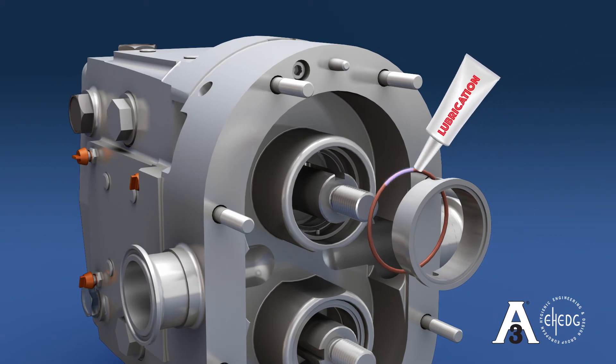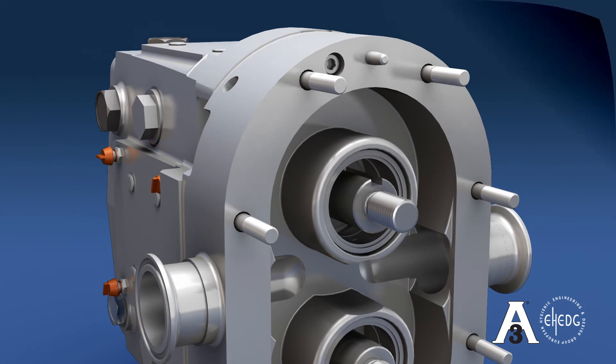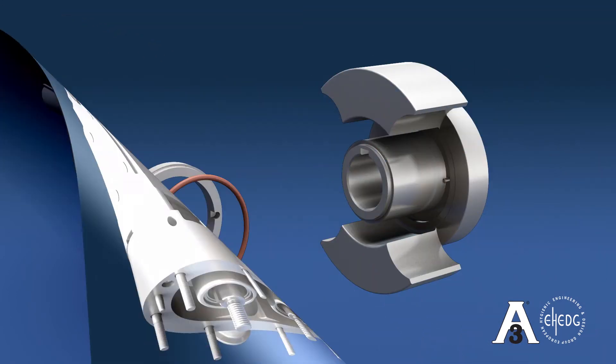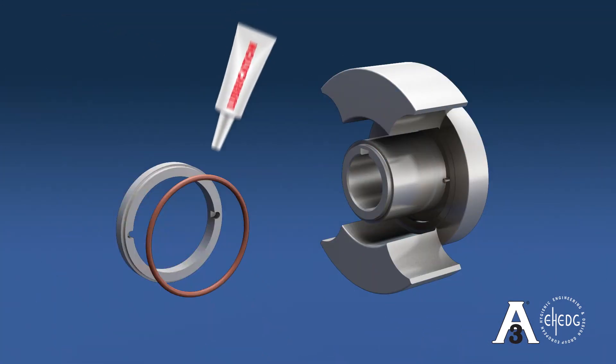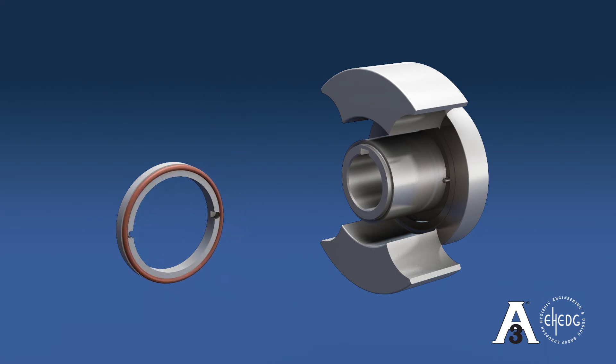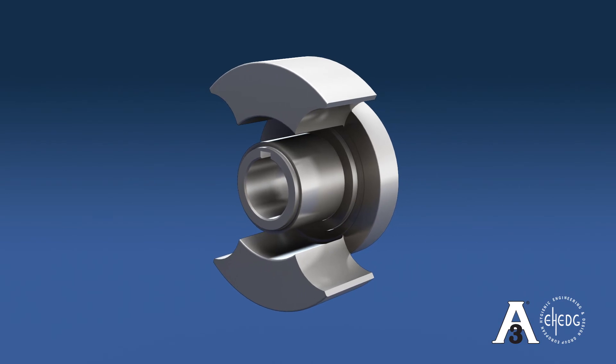Lubricate the O-ring and place over the seal diameter. Press in the seal by aligning seal pins to notches on the seal. Insert the rotor keys back onto the shafts, making sure the rounded end of the keys match the same keyway profile on the shafts. Reinstalling the rotating seal: lubricate the outer O-ring and place into the groove on the outer diameter of the seal. Align the notches on the seal to the drive pins of the rotor. Press the seal down, making sure the seal is completely seated.